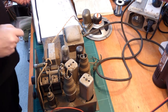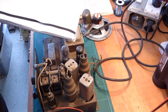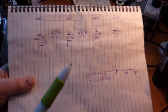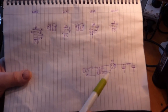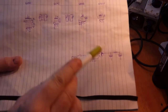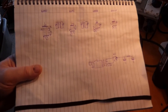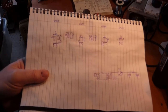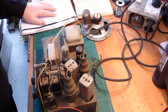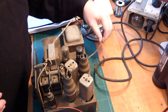I've put all the boilerplate schematic drawn out here — there's bound to be an aerial coil here, and I probably could have done this power supply area more completely, but until I actually see exactly how it's drawn up I didn't see any point in going further. That's typically how I do it; it just makes life easier to have a starting point rather than try and scribble things in. So where to next — we can follow the aerial wire in.